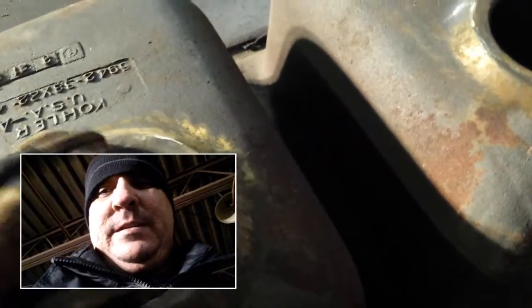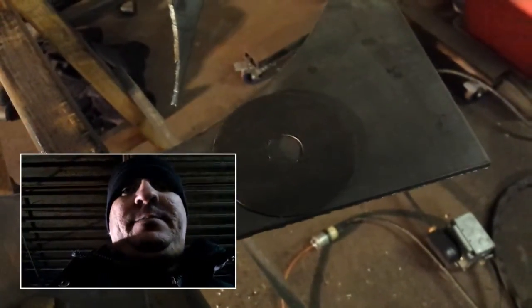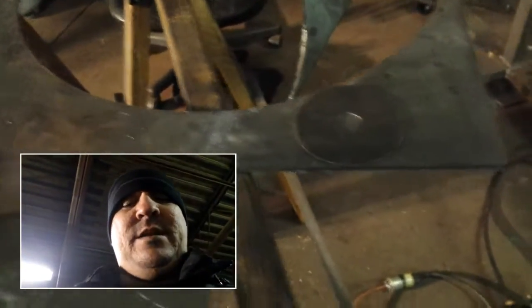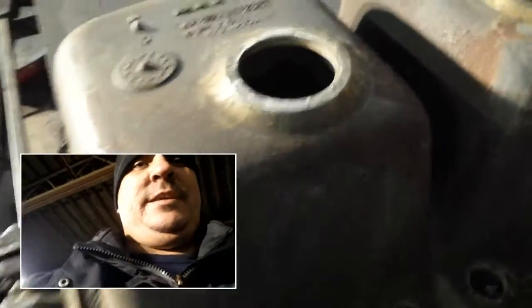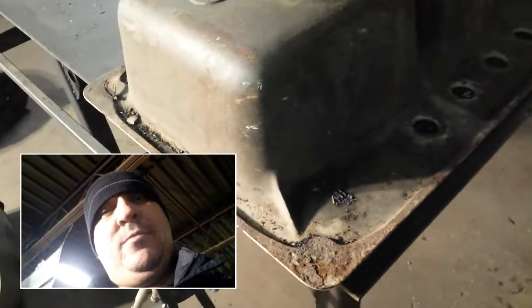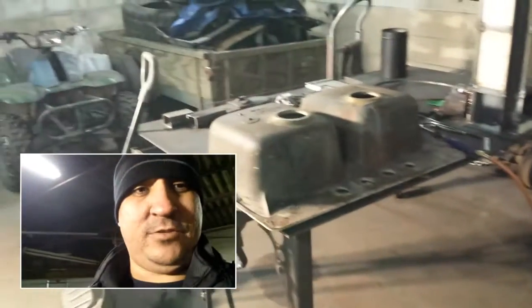What I discovered here — let me show you real quick — this used 4.5-inch cutoff disc fits pretty nicely right there, so I'm going to use that as a circle cutting template. I've got 3/16-inch plate so I can cut out my two circles. I'll clean up the edges, get all the dross off so I don't have any more contamination making this welding process tougher. One concern: this is a cast iron sink, so the inside has porcelain on it. I'm curious how the porcelain is going to hold up to being welded on — we'll learn that together.